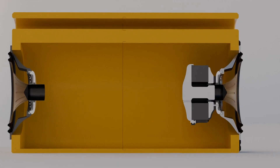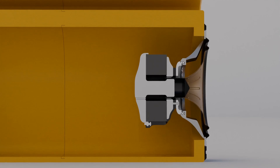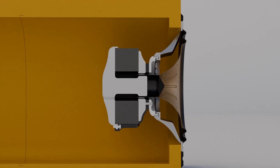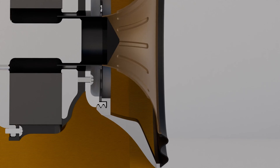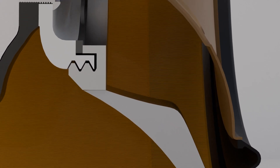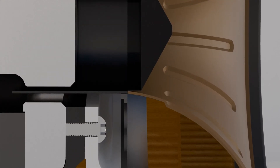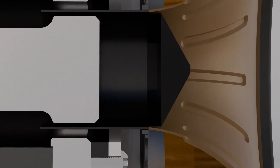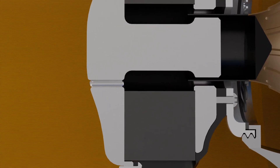Taking a look inside the enclosure now, we can see the whole assembly, starting with the active driver. The motor components are exactly the same as the previous version. The cone has a new shape and improved gusset geometry to facilitate vacuum forming. It still screws together to retain the spider, and the motor is still an overhung design to encourage longer throws. A dust cap has been added to seal the enclosure and boost pressure for the passive radiator.